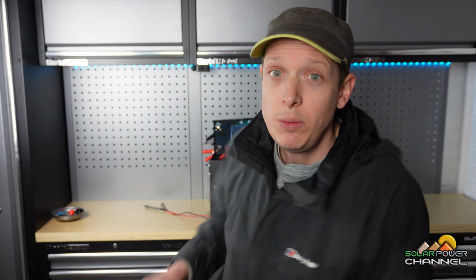Right, we are solar fans, the battery behind me is now charged. So I've written down some numbers here so it makes it easier for me. It took 16 hours and 15 minutes to charge. So being a 10 amp charger, the battery swallowed 160 amp hours of juice. So assuming this is a 206 amp hour battery, which we'll find out very shortly, there was 46 amp hours remaining in them batteries. So that works out around about 22% capacity in this battery when it was shipped.